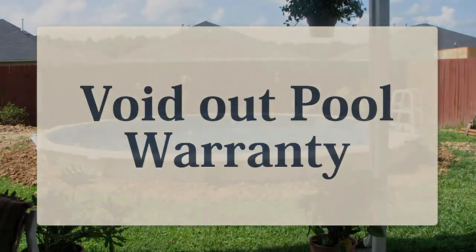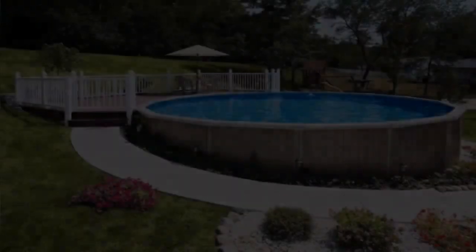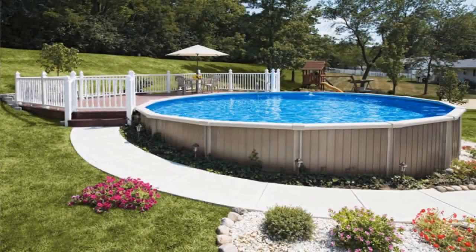However, with a proper slurry mix between the pool walls and earth, it can be done. It is just more expensive to do. One would have to weigh the costs of doing this or opting for a semi-in-ground pool. If your yard has a slope, or you are planning a deck and want to use fewer materials in constructing, then a semi-in-ground is perfect for your situation. This picture represents a backyard that is perfect for a semi-in-ground pool. This pool takes advantage of a sloped yard, and the deck is made with less materials.